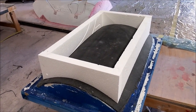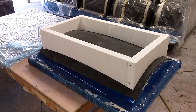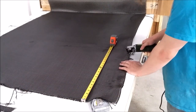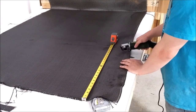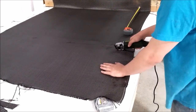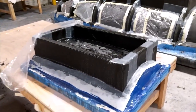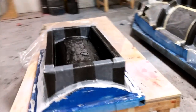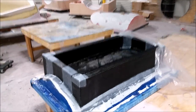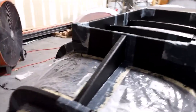The next thing is a mold we did a while ago for the upper door skins, so it was time to do the bracing on that. We quickly cut those braces on the CNC, and here's Devin cutting out some carbon fiber — this is how we do it. We got a new cutting wheel which actually works pretty nicely. With the magic of television it's done, though it actually took a couple of hours because there are two layers on there.